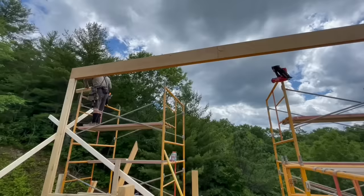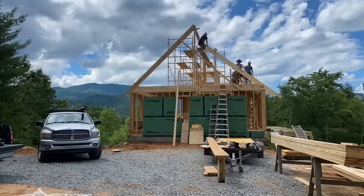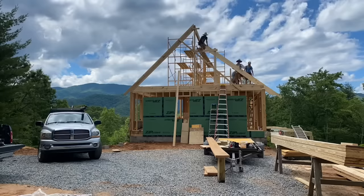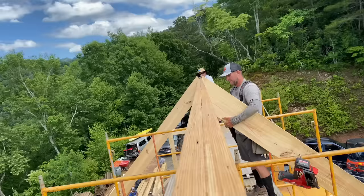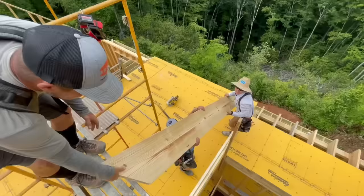For any of you wanting to learn more about structural things like how a house goes together: this section of ridge beam is not load bearing. Even though we use this big beam, we're just using it to match the rest of the ridge beam which is load bearing. The reason this section isn't load bearing is because it has rafter ties — they're the floor joists that keep the lower walls from spreading, so there's no way the ridge could drop. It basically has no weight on it.